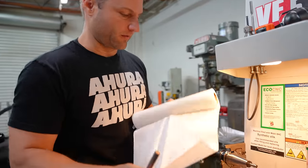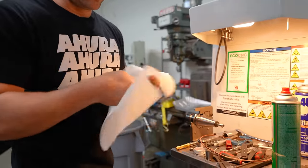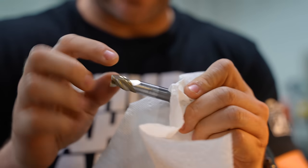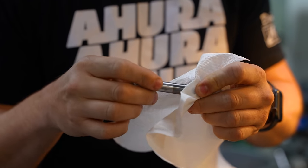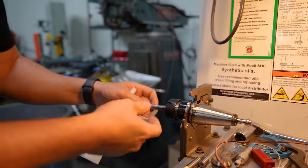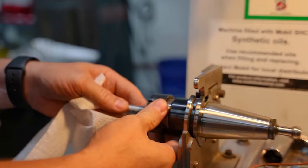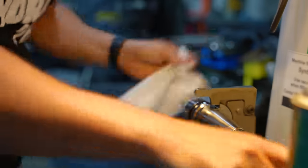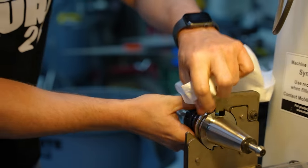I'm actually putting in a weird-shaped tool to help me. If you look at it, that makes sense, a little cutter. But it's actually got a shank that's smaller. This isn't gonna hit the sidewall as this goes deeper and deeper into the piece. This is my biggest holder I've got. This tool in the machine, measure it out.